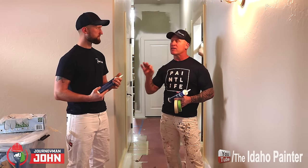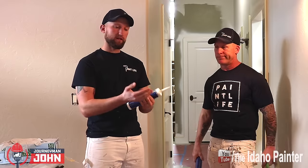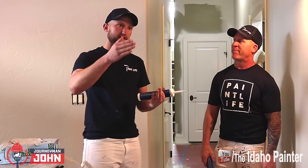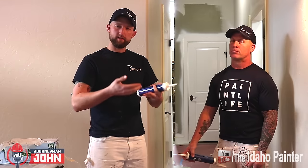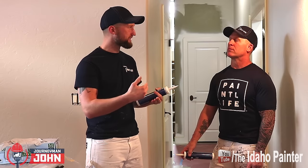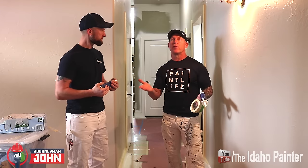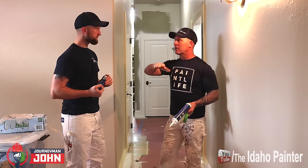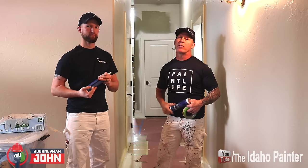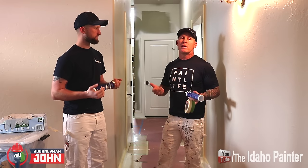One of the reasons we don't always use clear is that white caulking is a lot thicker. What is that, John? It builds up and lasts a little bit longer, and it doesn't shrink as much. The clear caulking, because there's less body in it — it's mostly acrylic — dries clear but shrinks quite a bit. That's where you might run into problems with gaps: if you've got a gap between your trim and your wall, the clear doesn't hold it as well as white would. Eventually when the caulking and paint dries, the clear is gonna shrink a lot more and you may have to redo it.